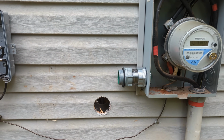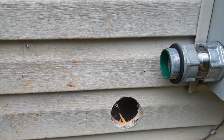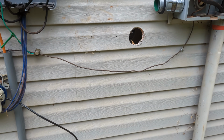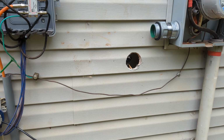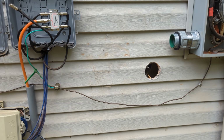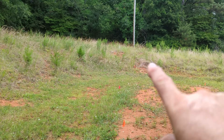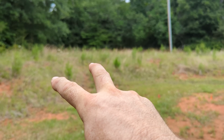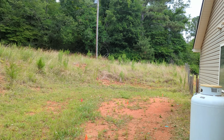We're on a power company that really doesn't allow for net metering anymore, and it would cost this customer almost $100 just to have the privilege of putting solar panels on his property. We're not going to do that to him. We're going to make this with time of use settings, the battery, the 15K, and the solar. We're going to do the solar later. The solar is going there, and it's going here. It's going to be a morning southeast facing and a southwest facing array away from the power line.